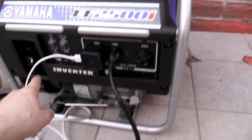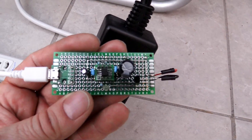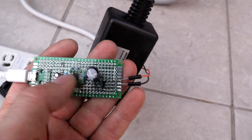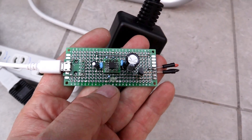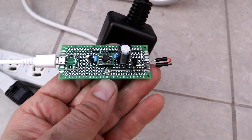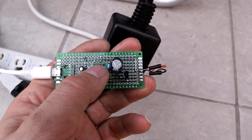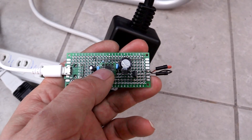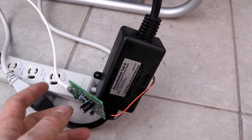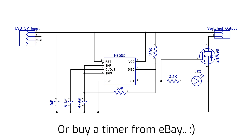We've got a USB power supply here, and that's coming back down to this thing. Now what's going on here? Well, we've got a 555 timer - USB comes in here for our five volts, and then two wires coming out. So this is just a timer, an astable multivibrator. It basically turns on and off endlessly as long as it's got power. The values I've selected will give us 10 seconds off, then one minute on. So it stays on for a minute, then it turns off for 10 seconds, on and off continuously. You can see the diagram on the screen there if you want to make one of your own - it's not that difficult, just a few bits and pieces.